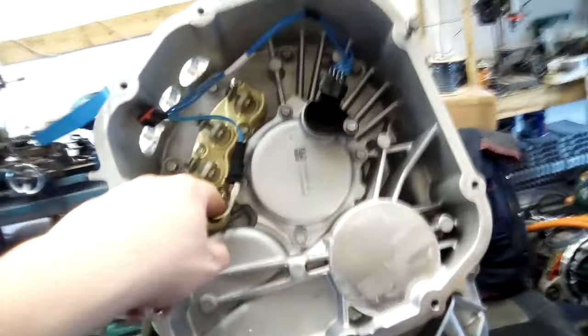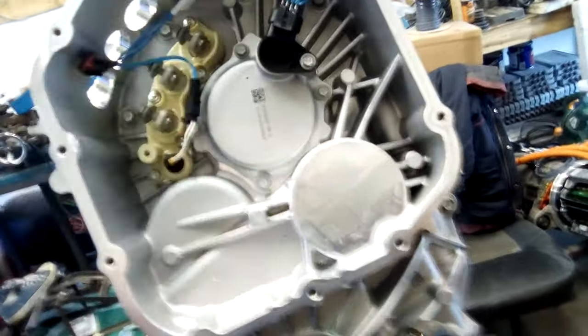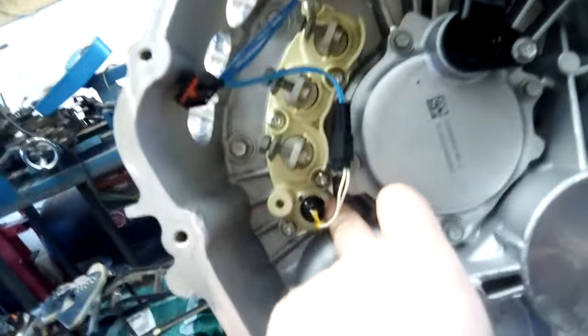There's a pump - I'm guessing behind there is the oil pump that circulates the oil, although I'm not seeing any power to it so it must be mechanical. That's a bit disappointing - I thought it'd be electric. Anyway, obviously there's three-phase input and we'll get that spinning probably later today. There's also a temp sensor which is going to be a thermistor with two connections. It's obviously detecting the oil - this is the bottom actually, so it might be an oil level sensor, but more likely it's just a thermistor to detect temperature.